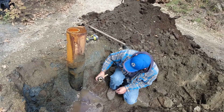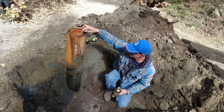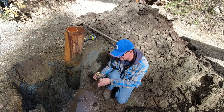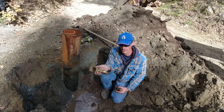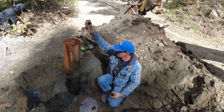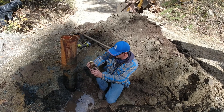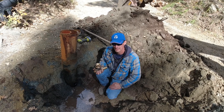So now we've got to cut the casing pipe down here. Then I'll get this adapter down, put it through there, install the nuts and the seals, tighten it down, keep this piece outside of the well because this is what we're going to connect to our down pipe. And then when we drop the pump in, that'll be on the end. The pump will go all the way down through the internal casing, and once we get it all the way down, this piece will slide right in and create a watertight seal. Then our water will be below the frost line when it's pumping out.